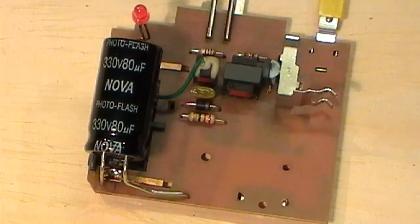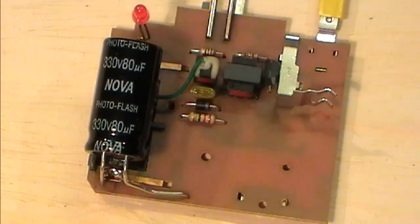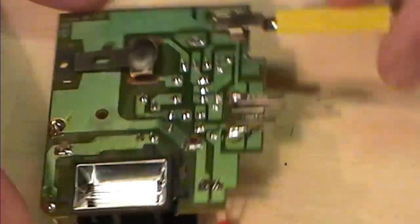Again, this is sort of an experiment. I know some people do a lot of joining of non-resistance and resistance wire, twisting, crimping, this, that and the other. This uses a spot weld philosophy. So you're touching the two together, and effectively you're melting the two wires together. Nice clean joint.